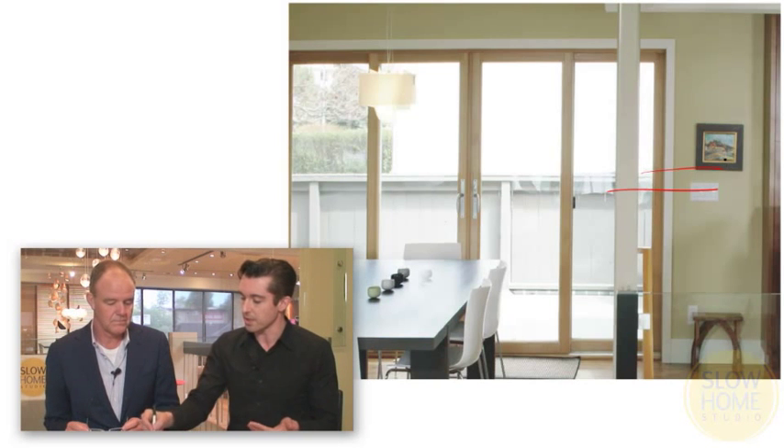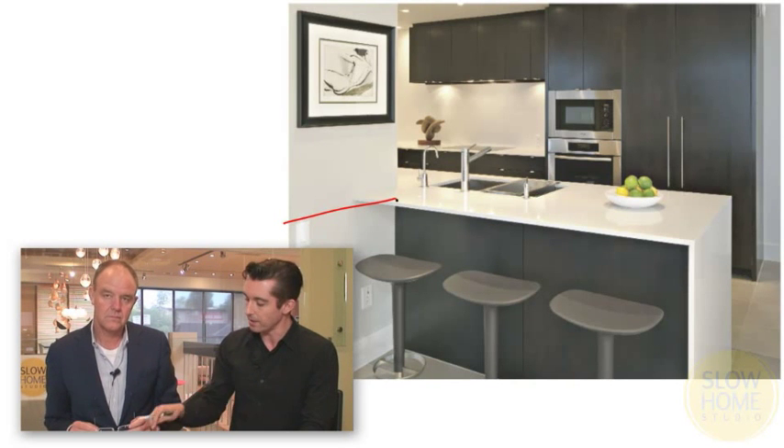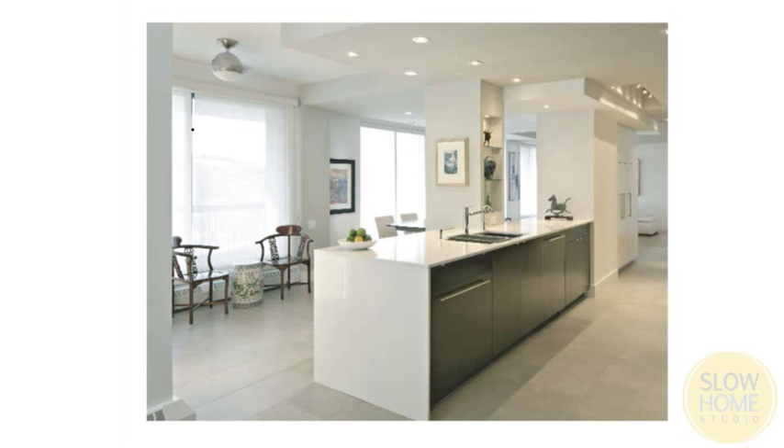Here's an example: when it's at 48 inches high, the artwork is really close if you place it to the top of the switch, and there's visual conflict — you always see that light switch up in your visual field. By lowering it down to 32 inches it's below the line of a counter, more subtle in the room, allows artwork placement to be easier. In this example — a view of the same kitchen from the other direction — you can't even see the light switch. There's no conflict.